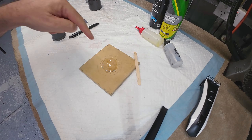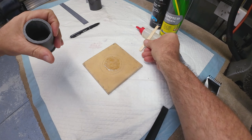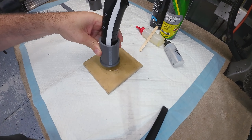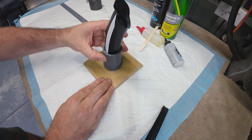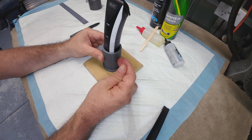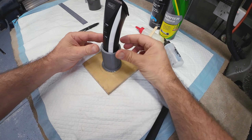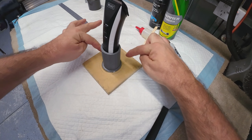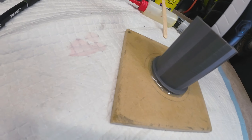I just got the Dremel and put a few zigzag cuts in it, same on the bottom. I'll put that there. Now I'll put the 3D print in, square it up, give it a turn — doesn't matter if a little bit of epoxy leaks out because I'm going to go around it with caulk anyway. There we go, and that's it. I was going to put super glue too, but it's not necessary — it's pretty tight, it's not going to go anywhere. That actually looks quite good — there's a nice little bead of epoxy all the way around it. I used the five-minute epoxy, so it's already going off — it's hard to move. The clippers are parallel to the edge — perfect.